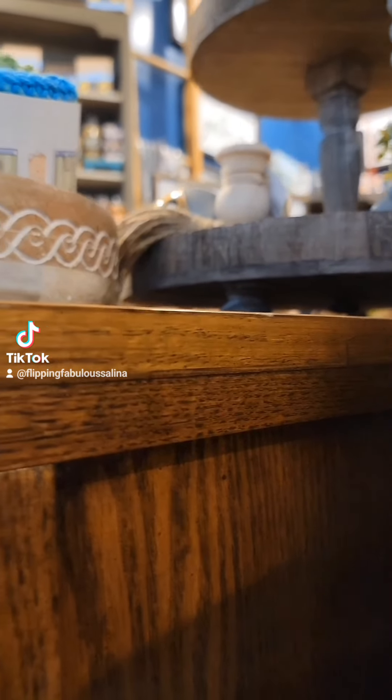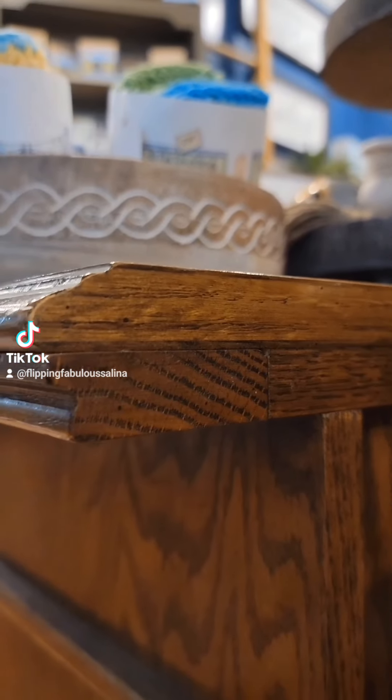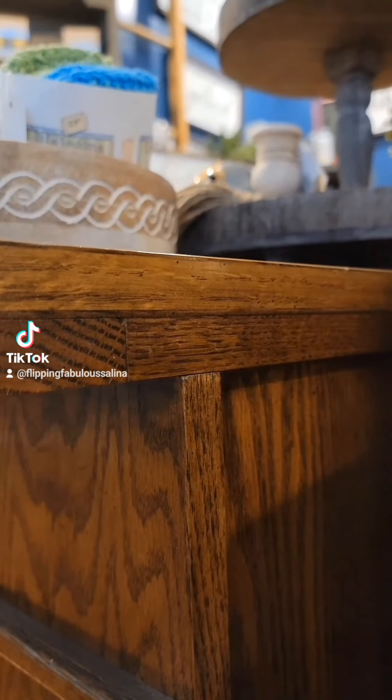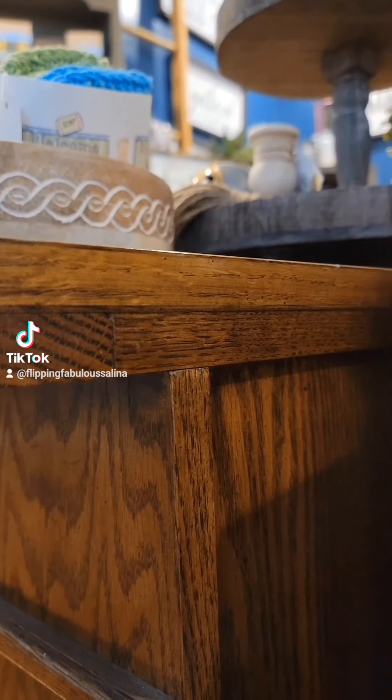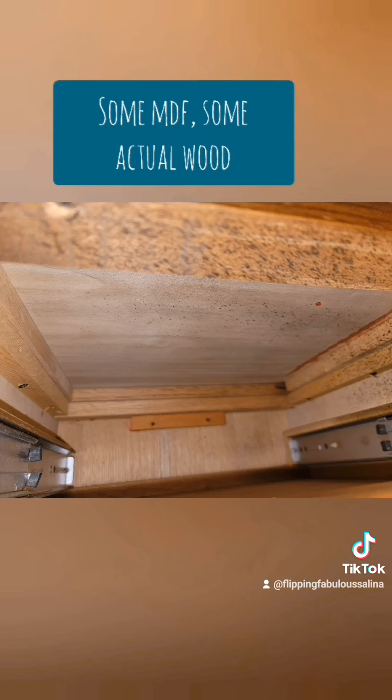On this piece it wouldn't matter so much — you could just remove the entire veneer and then sand the top. When we go around to the front you'll be able to see the MDF. It composes a lot of the structural parts of this dresser or credenza, so some of the framing has that MDF, and you can see it there. It kind of looks like corkboard, and underneath is a solid wood top. It's a really nice piece and I wouldn't be worried about this MDF swelling or getting misshapen over time.